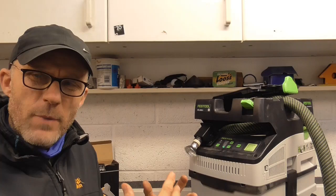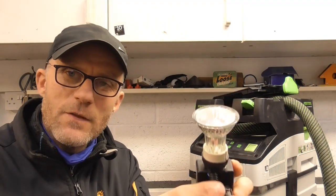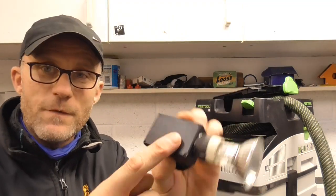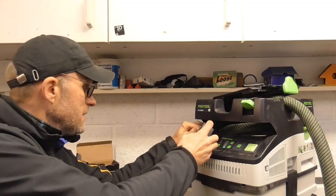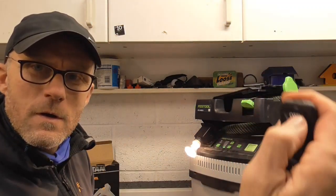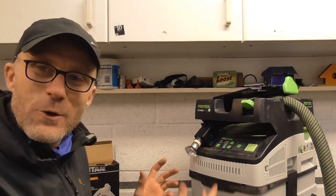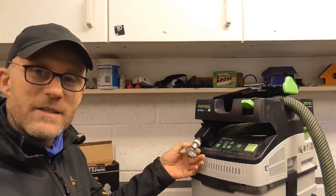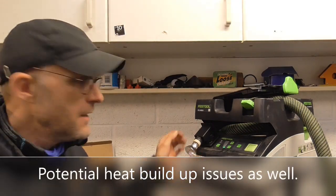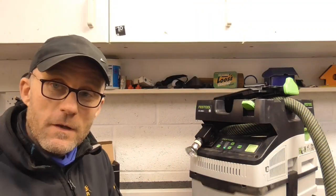It's really - I don't actually need this, it was just the concept I was playing with. I'm sure somebody could easily take this concept and make it work perhaps more effectively without having to use a light bulb. You can get dummy load resistors that simulate an electrical current, and maybe one of those would fit inside this box. Although this works perfectly as I showed you, I suspect on site this bulb hanging out here would probably not be the best idea.